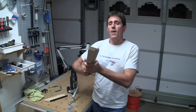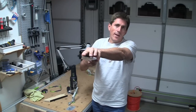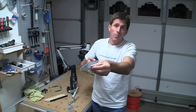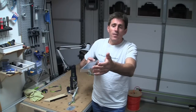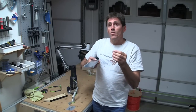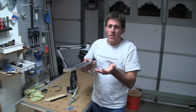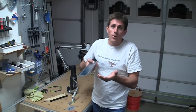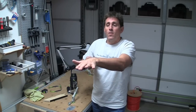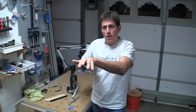The reference surface I care about the most is this flat middle section. If the beads don't line up absolutely perfectly, I can very easily sand those. Even though I've already painted, colored, and finished them, I can easily touch them up with a black dye, and then when I put the final coats of finish, they'll be taken care of. The reason these were pre-finished and pre-colored is simply because it made assembly a little bit easier — there are probably a hundred ways to do it, that's how I chose. So this middle part is the reference I want to go off of, but there's no way I can put the domino fence on here because of these beads.